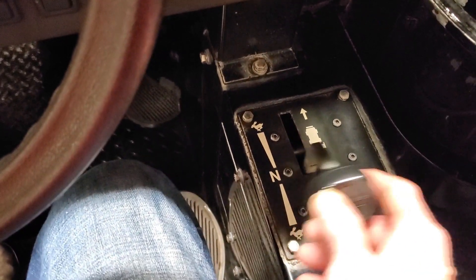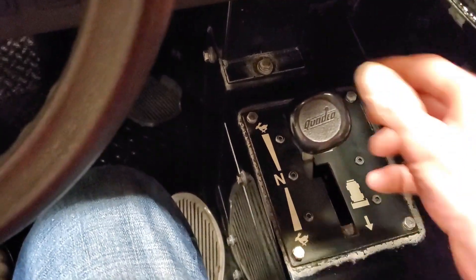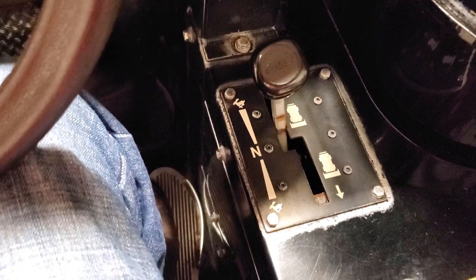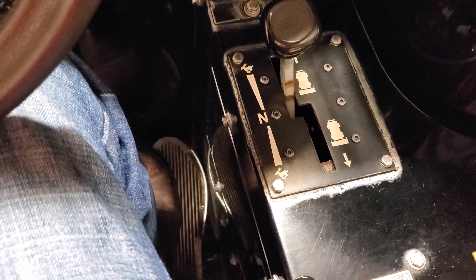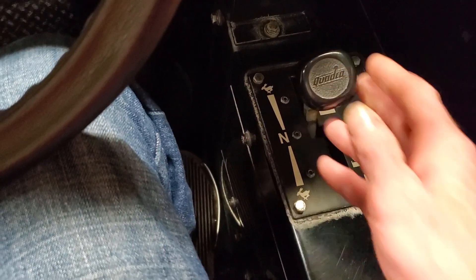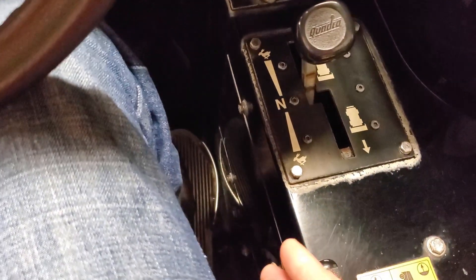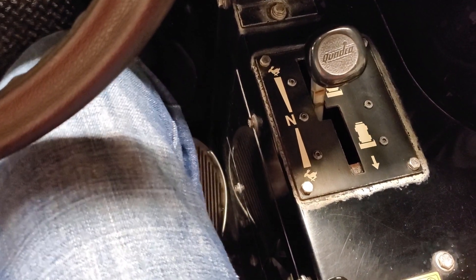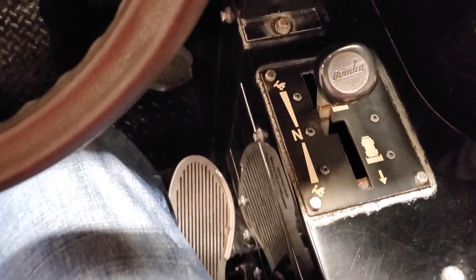For general ice resurfacing, I set this lever so that my foot is all the way down when I'm making my passes up the middle of the ice. The foot pedal controls the amount of power to apply from the transmission — the lever sets the power, and the pedal releases it. More pedal equals more power, less pedal equals less power. That's how a hydrostatic transmission acts as a braking system — when you take your foot off the pedal, the machine comes to a stop.